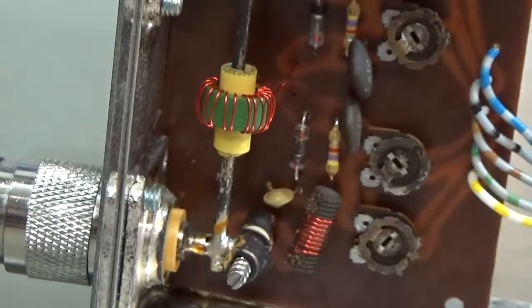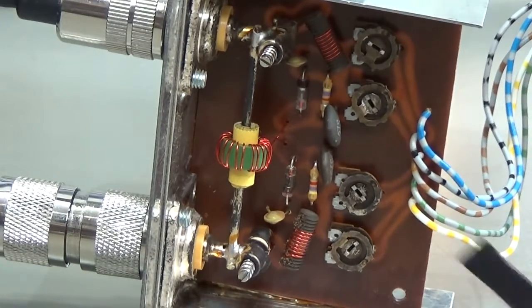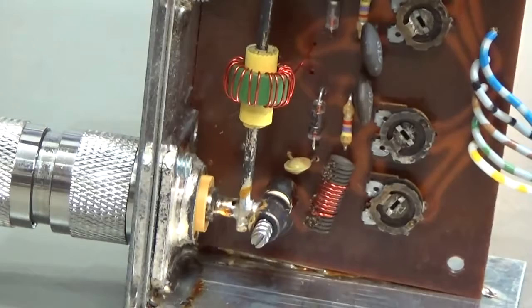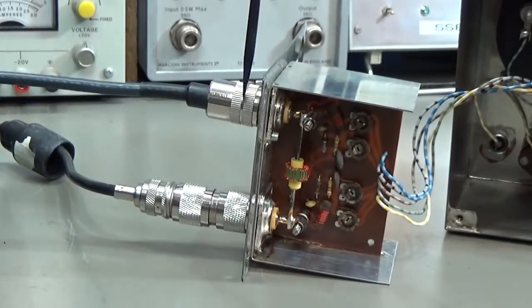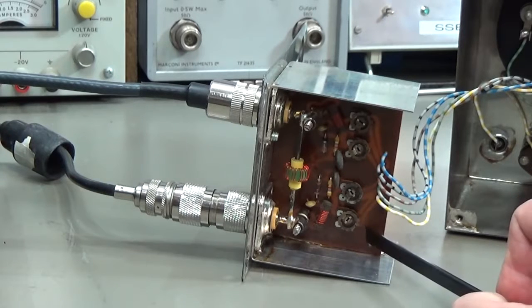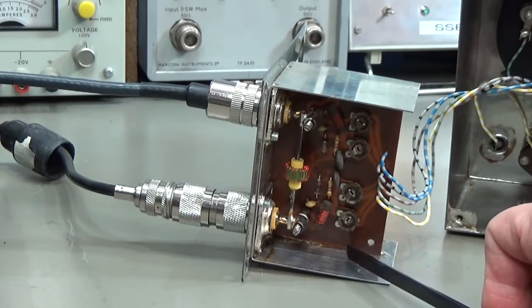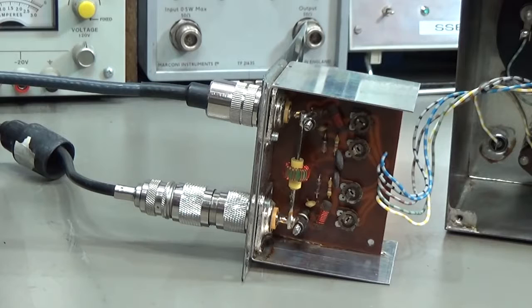Back to two kilowatt and you can see there is a reading of full power because it is connected in reverse, but no reading on 200 Watt. We can already be sure that our diodes are fine because otherwise we would not see any reaction. What we need to check is these pots - or it could also be that something is wrong with the switch inside. We also see that these pots are dirty and very often these pots make trouble after a couple of years of operation because there is some corrosion on them.